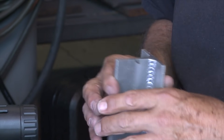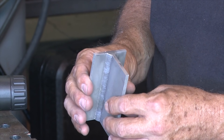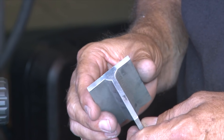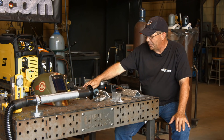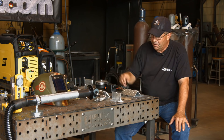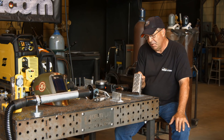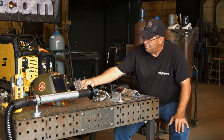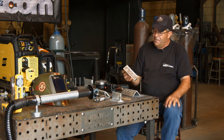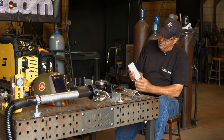It's that cleaning action of argon - you keep your wire pointed forward just a little bit. So I've got a question. Let's say I'm wanting to mock up and build a toolbox out of aluminum diamond plate. This happens to be 3/16ths, which would be a good stout material to build it out of. But we've got outside corners - do you weld them uphill, downhill? How are you going to treat that gun angle?